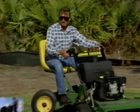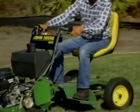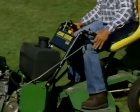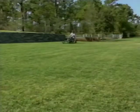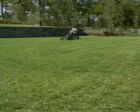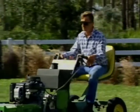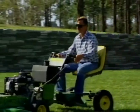If you want to use a sulky and ride while you mow, proceed slowly through dips in the terrain. The handlebars can come in contact with your legs and possibly hinder your operation, especially during turns. You should use a sulky primarily on flatter terrains. Make sure you are the only rider on the sulky. Additional riders can be struck by objects or they can be thrown from the machine.